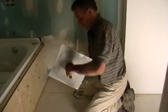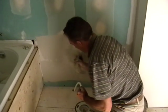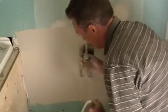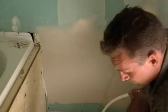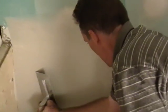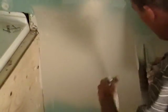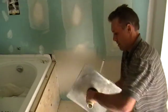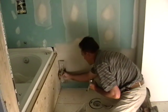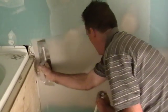Switch to the other side. Back in with the trowel, make sure the water pipe's not going to bug me. Go a little wider than the original joint. Borrow mud and bring it back. Now I start wiping my trowel clean, feather the top off, borrowed mud and brought it back to the edge of the top, feather the bottom off so that it feathers off. There's barely any sanding there, and that's what we want. Organize my mud, now let's skim this down and make it look really nice — right down tight for the bottom. If it doesn't cause a little dry line then I am done with that joint.